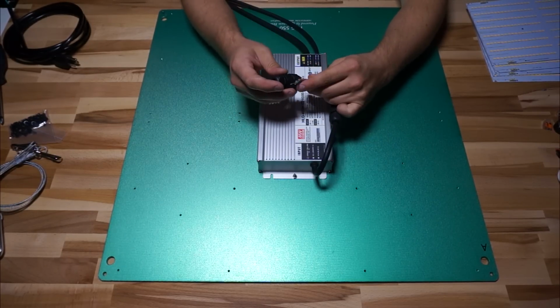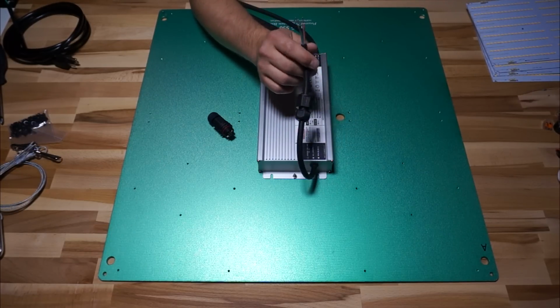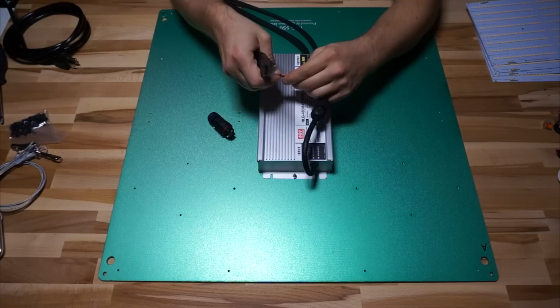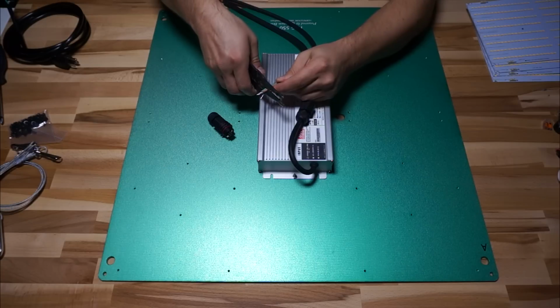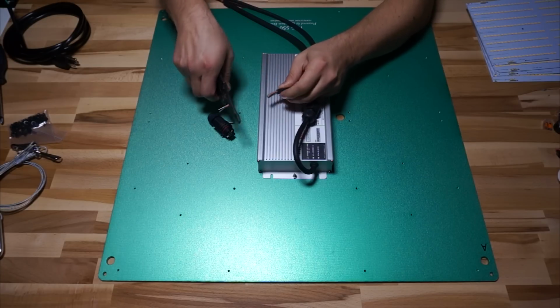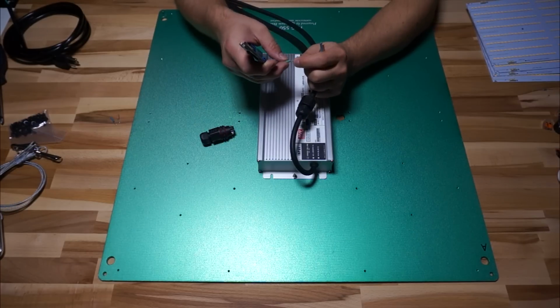Out of the box, you'll find that the leads on the power side are a little bit too long for this connector to work nicely, because if you leave them that long, then the strain relief is going to clamp down on those 3 conductors and not the black jacket. So I shorten them up to a nice reasonable length and then restrip them.